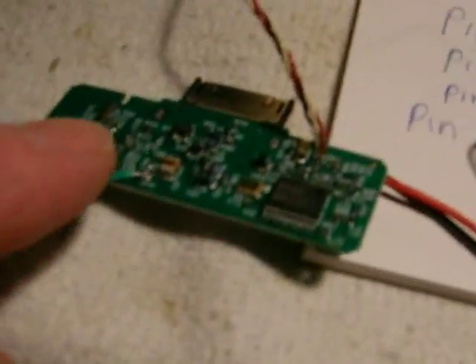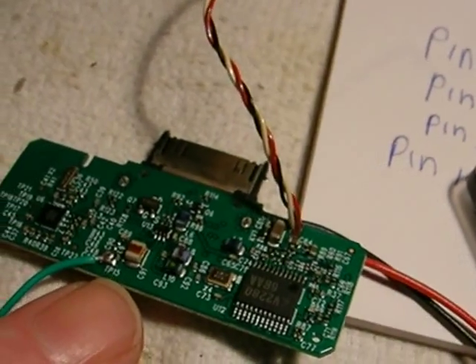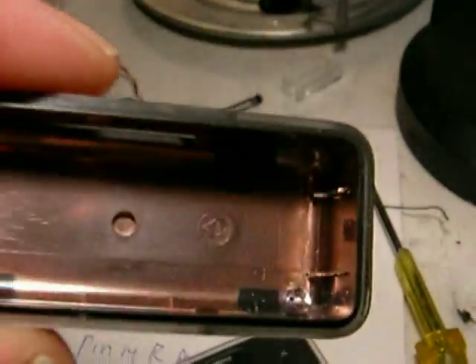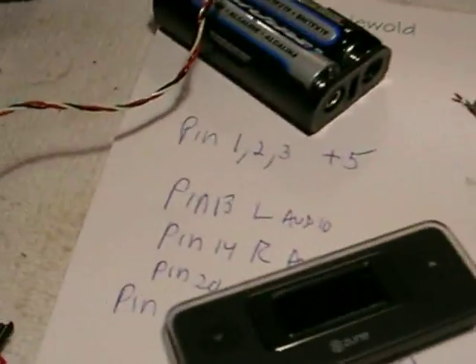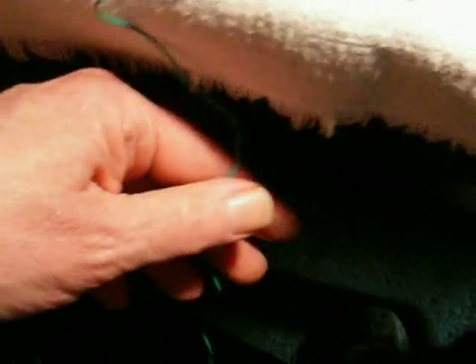Pretty neat trick, but that's the only purpose of this little chip here. Now, to add an antenna to these things — you will see this right here, it says TP15. When this thing comes from the factory, there's a little gold connector that makes contact with the copper-plated plastic back, but it's not enough of an antenna. So I solder a wire onto this — about a two-foot wire for an antenna — and that'll get you all around the house.